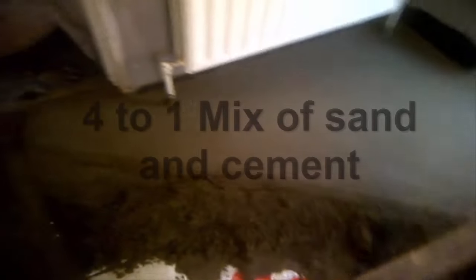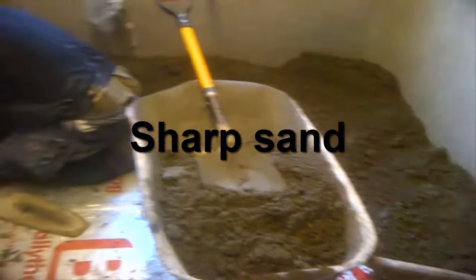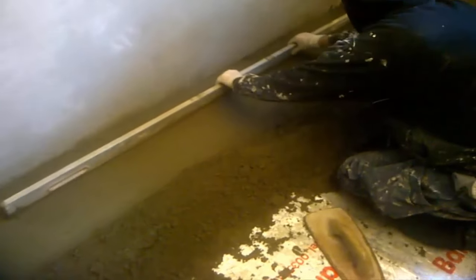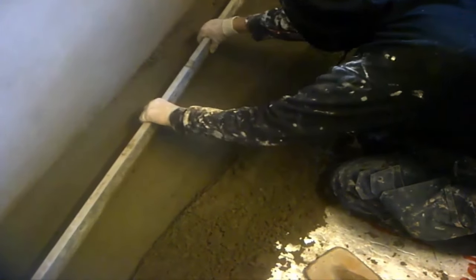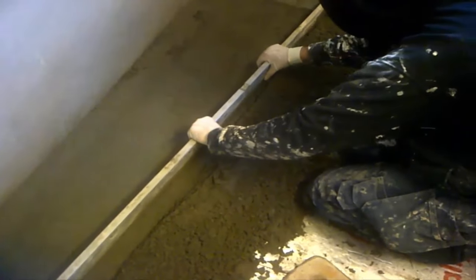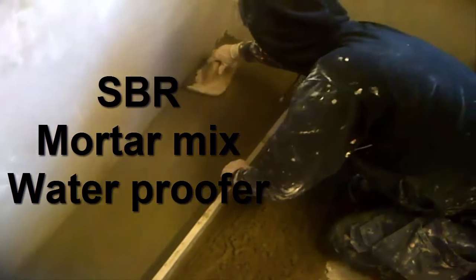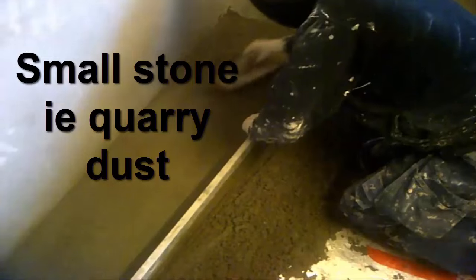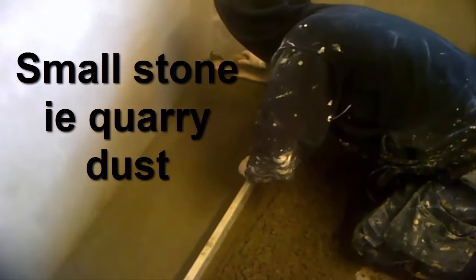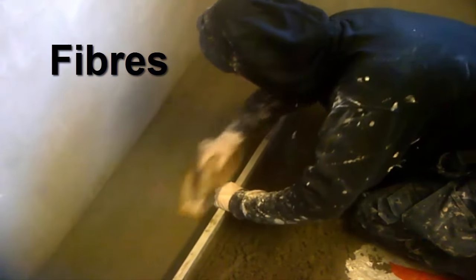Quick recap: screed is a 4 to 1 mix of sand and cement — you want sharp sand, and the sharper the better. It consists of mainly three main materials: sand, cement, and water. If you have damp sand you don't really need to mess about with water too much, as it is a semi-dry mix. There is another ingredient you can add — SBR waterproofers and mortar mixes to enhance strength and waterproofing. You can also add small fine stone chippings or fibers to add strength, but those are all optional. The main ingredients are sand, cement, water, and a 4 to 1 ratio.